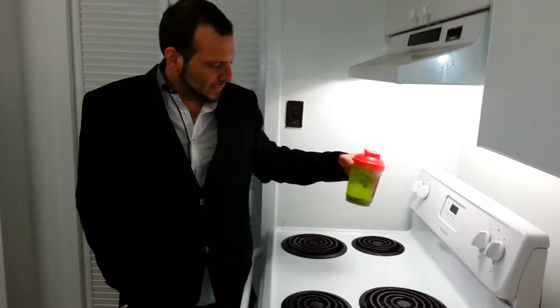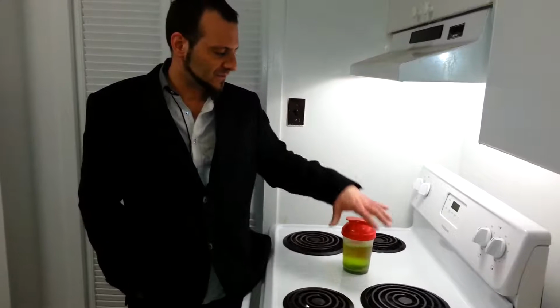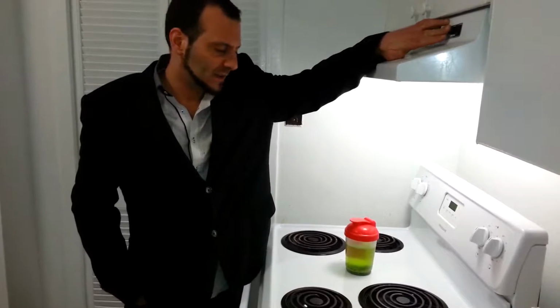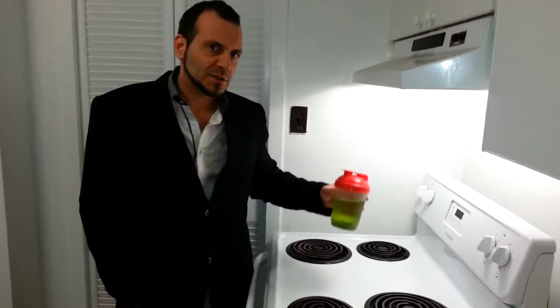In the meantime, you want to put this probably in an area where you have something called a vent. This vent will allow any excess fumes that are coming from here, even though it's very little at this point, to escape. You're going to leave this for about a couple of hours, shake it, another couple of hours, shake it again, and after about 12 to 24 hours, we're going to have a solution that looks a lot darker, but with most of the gold off of those fingers. And then you will check out my next video, which will show you the next step.